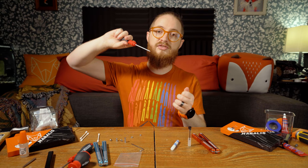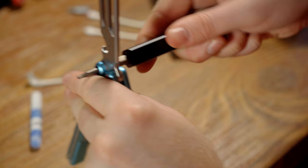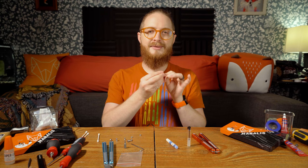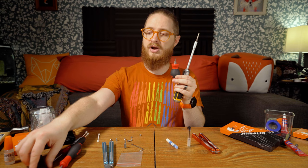This tool was specially designed to mimic the end of a full-sized screwdriver. A full-sized screwdriver is very useful for assembling your Vulp because you can use it to push through and align all the different elements. This allows you to do that without owning a full-sized driver, and it does it even more perfectly because it's measured to be exactly the diameter needed to align everything. You will need a screwdriver with a replaceable bit to use it — but most people already have one of those in the garage. It'll fit any normal screwdriver, be it a stubby, a Bally driver, or a regular screwdriver.